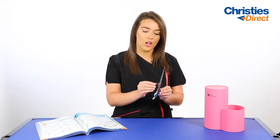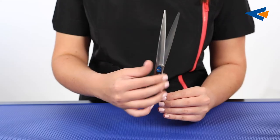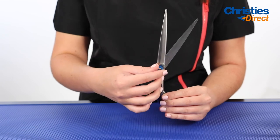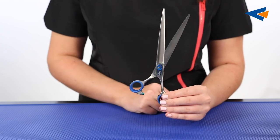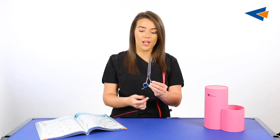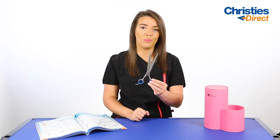It's literally a case of trial and error. You would go about twisting this little screw ever so slightly until you get the desired result. What you're aiming for is for them to close two thirds of the way — not completely and not not at all, just two thirds of the way. I've gone ahead and adjusted the tension until I find the perfect spot. When I lift this side up and let it go, it falls two thirds of the way closed, and that's how you know you've got perfect tension.